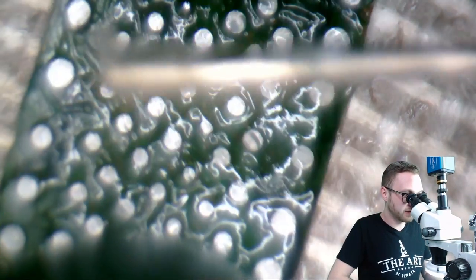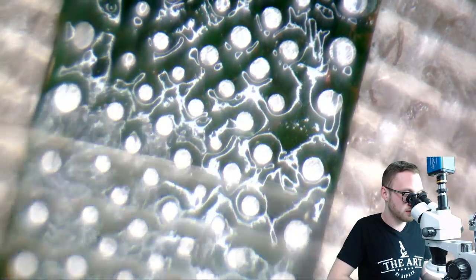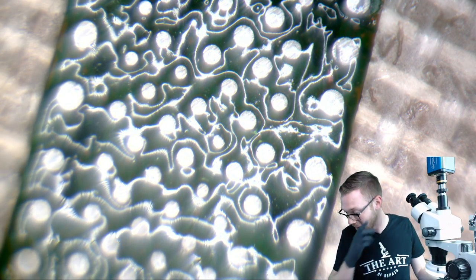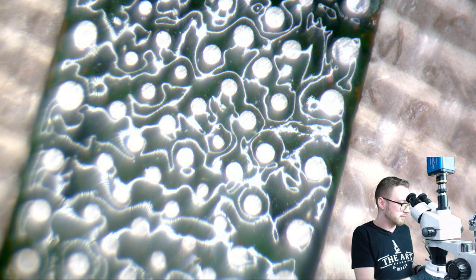Basically, the goal here is that once these things wet, you don't want them exposed to the air because they're going to oxidize immediately if they don't have some sort of flux barrier. Okay, and that's one of the main things about flux, it is definitely going to save your butt. If you're not soldering with flux, you ain't really soldering at all, are you? All right, so now we've got flux on there.